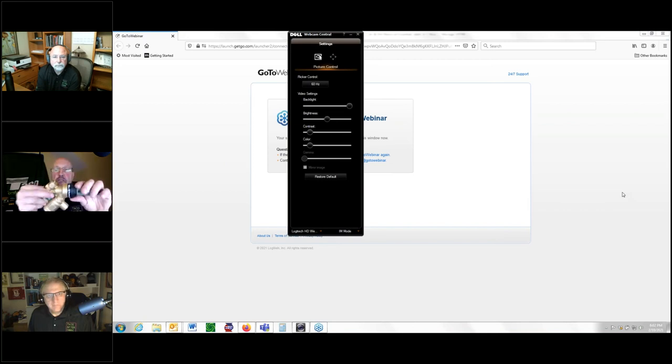And of course it's got the atmospheric vent that you're going to have to bring down to the floor. This part here, this black knob, if you wanted to, you could put a pressure gauge on it, but I wouldn't. That is actually a relief. So if you have the system filled, you shut your water supply off, which you're going to have a valve over here on your water supply in. You've got a check valve on the boiler side.